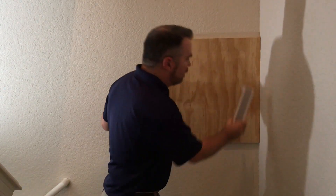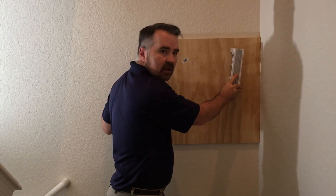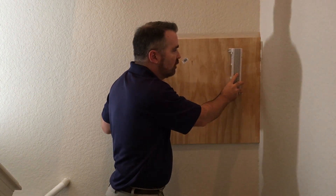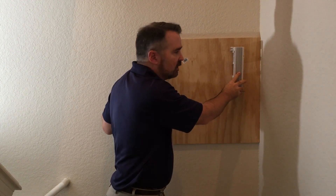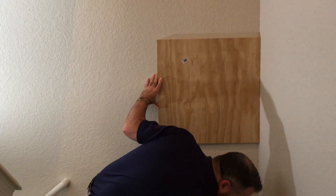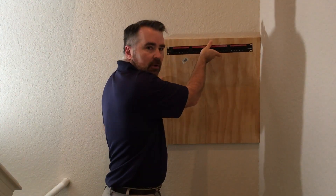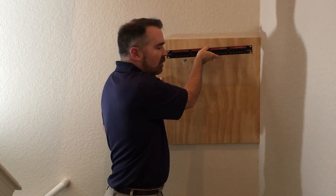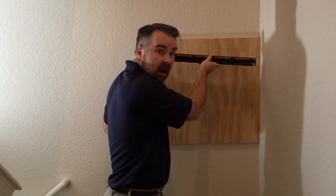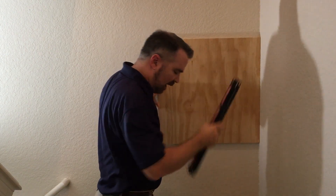For instance, you might have 66 blocks on a backboard. This is the wiring that goes from the 66 block out to the phones or other devices that need to connect to it, like fax machines — generally speaking about voice type things. Now in smaller environments, you may actually even have your data patch panel on your backboard. Typically in most medium and larger size data environments, you've got a separate data rack just for these things. But in some small offices, you might have your data patch panel there.